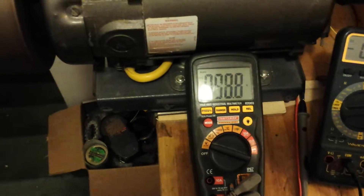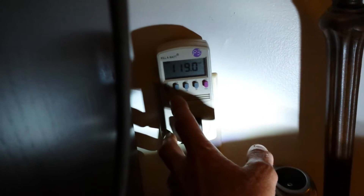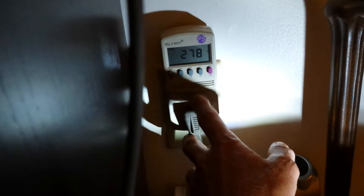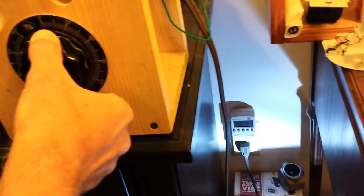We got 98.8 volts this time, and we're looking at 120 watts, with 119 volts coming in — that's kind of crazy. 2.35 amps, 219 watts, 278 volt-amps, 60 hertz, and 0.78 power factor, which we're going to pick right now. That power factor has got to be rectified by this. Let's see if I can get them both on. Okay, we're going to turn this down — it's about halfway.